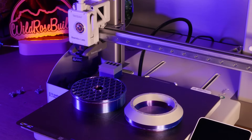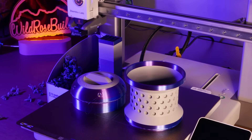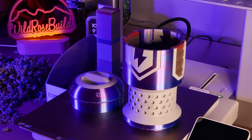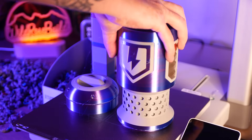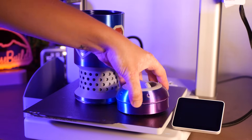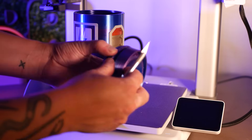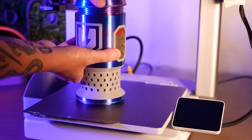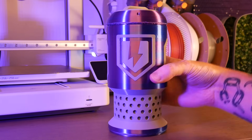This print was definitely a learning experience for me. There was way more purge poop than I anticipated, and my little poop bucket didn't stand a chance. I know there's ways to deal with this, like wiping into infill and tuning the purged amount, so I'll have to investigate that for future AMS prints. I scaled this model up a fair amount, and this meant the tolerances around this support ring also increased — that left an unsupported overhang and resulted in poor surface finish. I also ran out of both gold and grey filaments during printing and had to swap to new colors. But the model finished printing successfully, and for such an ambitious print, I think this one turned out great.